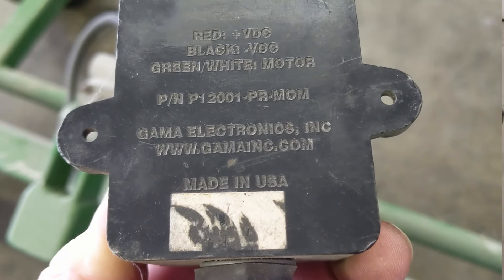Next, the rippers. I got these from Agra Supply — they were actually taller rippers originally; I had to cut them down and drill new holes to make them work. The rippers are a great feature but they're a pain to build because of that cutting and re-drilling. I drilled four holes in each ripper tooth: the first hole is for transport, raising it all the way up; the next hole puts the ripper tooth exactly level with the cutting edge so it just scratches the surface; the third hole puts it one inch below the cutting edge; and the final hole puts it two inches below the cutting edge. The ripper teeth need to be cut down because at full length the grader box doesn't raise up high enough to get them in and out.